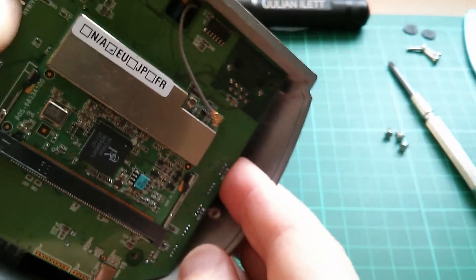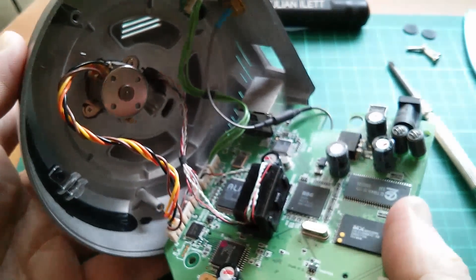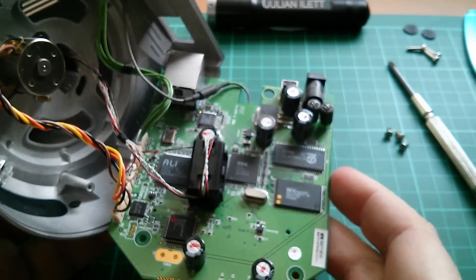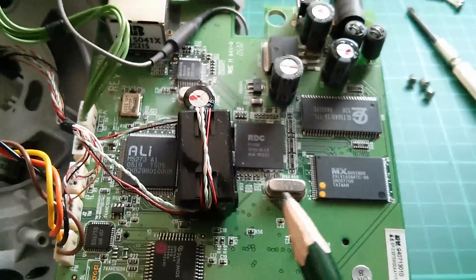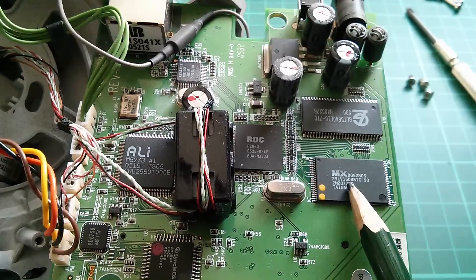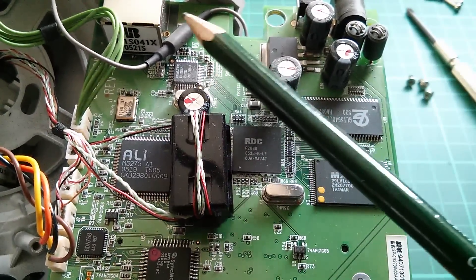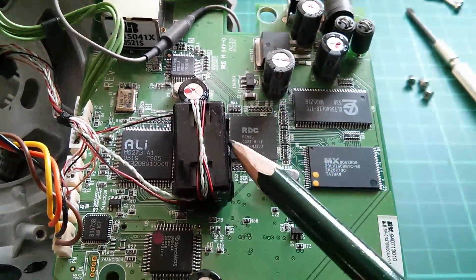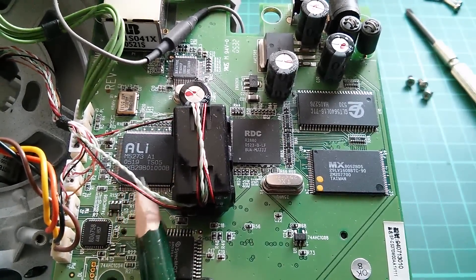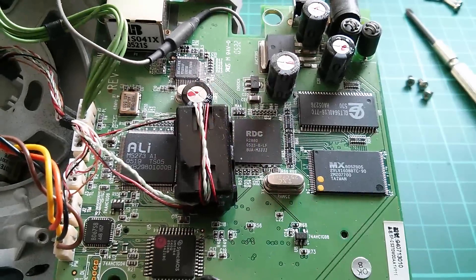I've undone the screws on the main board, so let's take that out. This is the pan motor, and that's the stuff on the main board. Let's have a closer look. There are quite a few very large-scale integration chips on here. These two look like RAM or memory of some sort — flash possibly. This one up here, the Realtek, I would guess is to do with ethernet and networking. There's a very large processor here — this is probably the main processor, or maybe it handles things like JPEG compression of the images and then sending it on to ethernet.